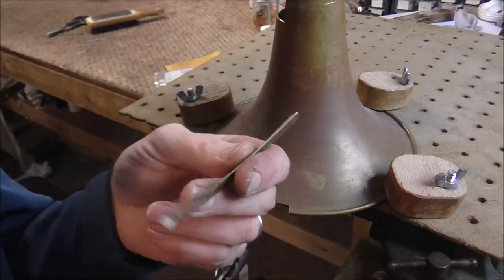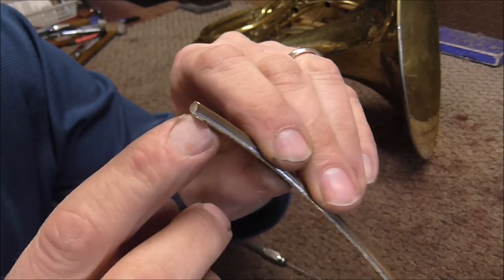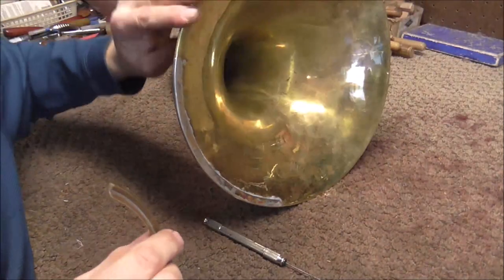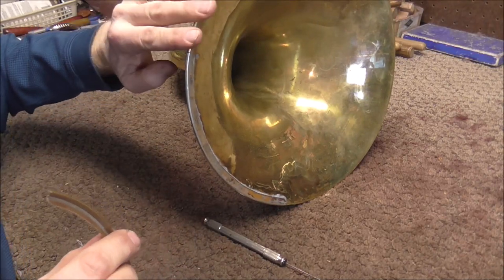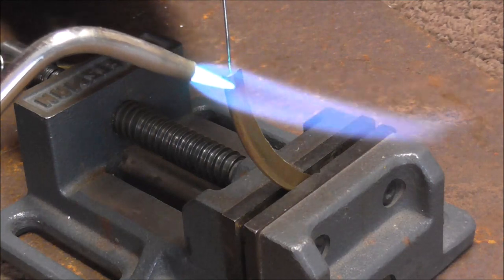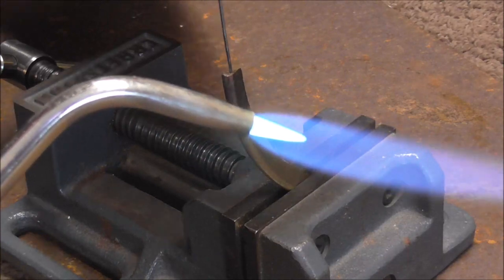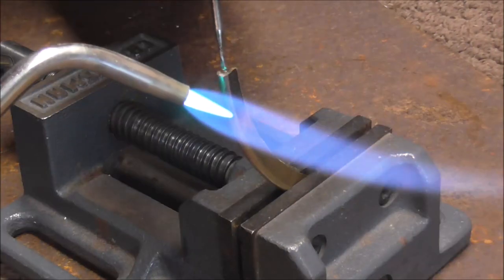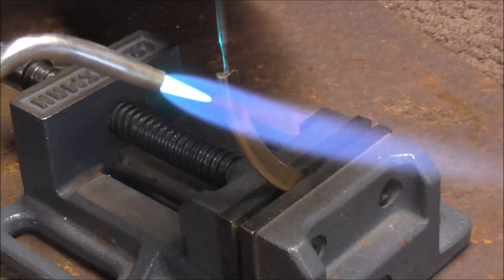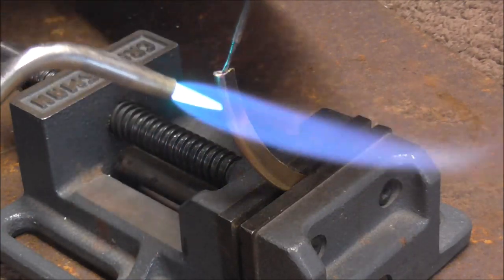There is the patch. This one has a brass wire inside of it and they also put some solder on there. So I'm going to need to melt the solder and then bend that back up so that it will fit around the rim of the French horn bell. I'm going to melt the solder and try to open up that ring a little bit. It is opening up a little bit. Now I'm going to start prying it open with a screwdriver — just a little bit at a time until I can get that ring out of there.